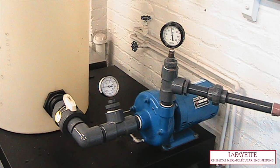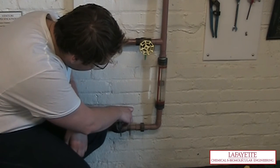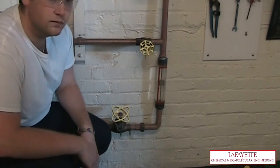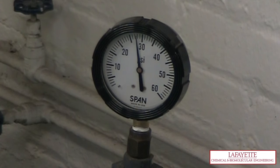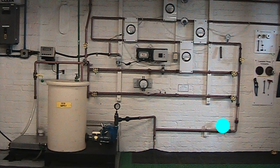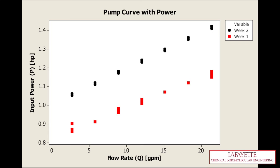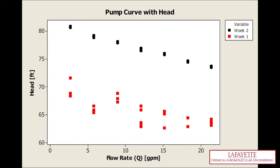The objective of this experiment is to find the change in pressure and power of the pump based off of the flow rate and impeller size in order to determine a pump curve. Set the flow meter to a given value using V150 and allow the water to recycle to the feed supply tank. Read and record the pressure readings going into and out of the pump as well as the horsepower being used by the pump. Test multiple different flow rates, at a minimum 6 in triplicate, in order to create the proper pump curve. With the proper reduction of the Bernoulli equation, this curve can be generated using the pressure drop and the power.